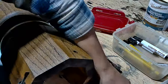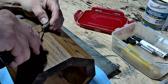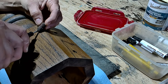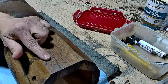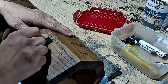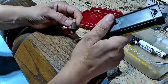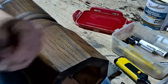I get asked quite often from people who want to refinish their own pieces of furniture, when is the best time to do your touch-ups? And the best time is after you've stained and done one top coat. And the reason for this is because all top coats will change the color of your stain. And so if you apply a wax in the stain color prior to top coating and it then gets darker, you run the risk of having a repair that is now too light for the piece and it will stand out. So my best advice to anyone who loves to refinish or is refinishing, always wait to do your last edits of a piece until after you've applied the first layer of top coat. This guarantees that you can get the best possible color match between your waxes and your stain.